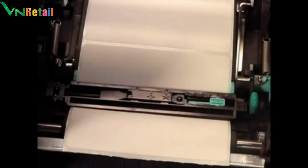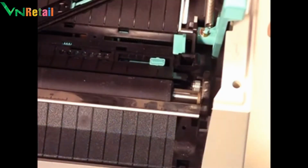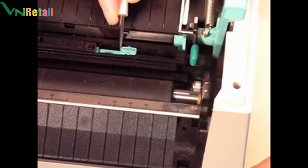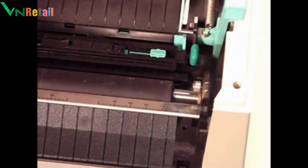Since the 452 is a center-justified machine, positioning the sensor so that it is a little left of center is usually ideal. The upper and lower sensors move independently, so it is important to make sure that both are located in the same position. Fortunately, lining up the sensors is quite simple, as both the upper and the lower sensors lock into one of 5 numbered positions.